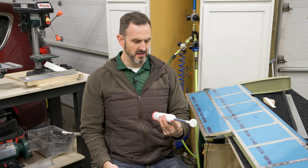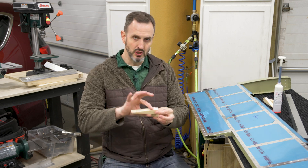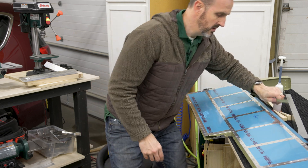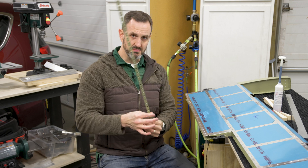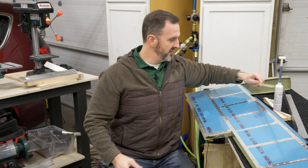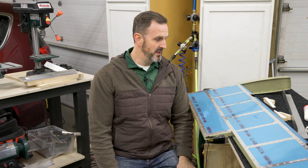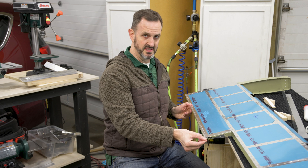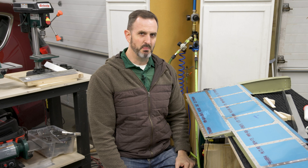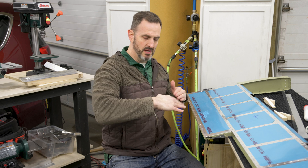What I need to do right now is basically put some of that glue on these two wedges, stick them in here, and then get this trailing edge wedge right here, put some of the same material on it, put it in here, and cleco everything together. From everything I gather online reading the forums and blogs, this can be a bit of a trick because you want this to be straight. When I go to rivet this together it needs to be straight, and I think that's part of why they want you to put this adhesive on here.